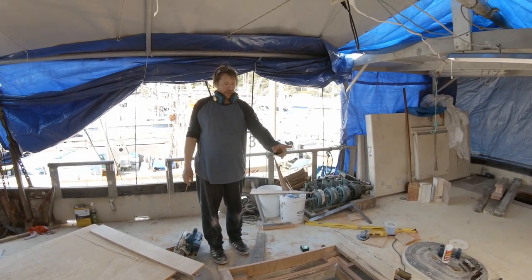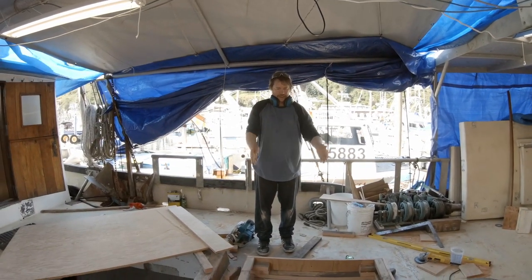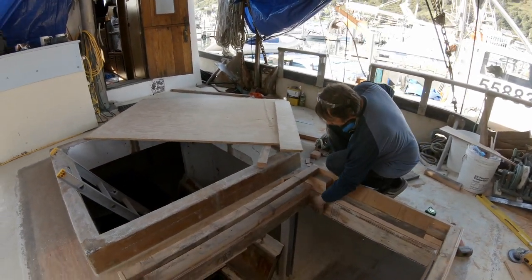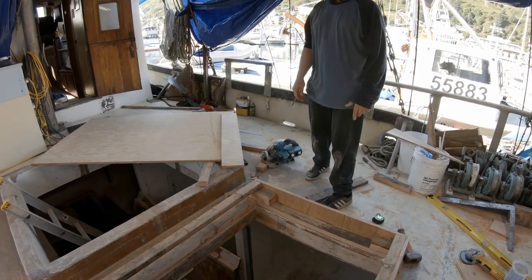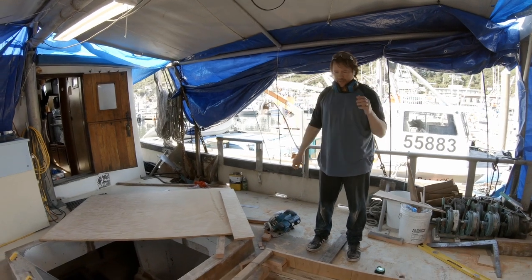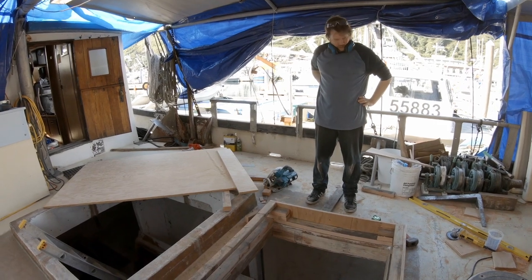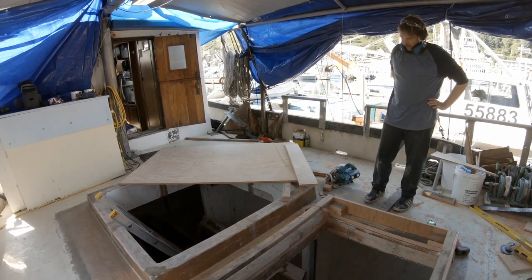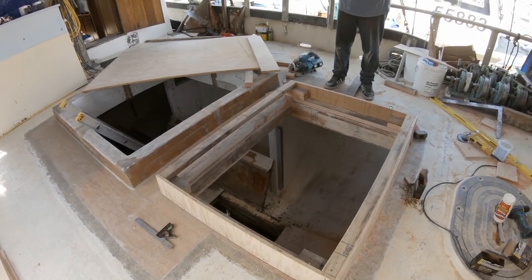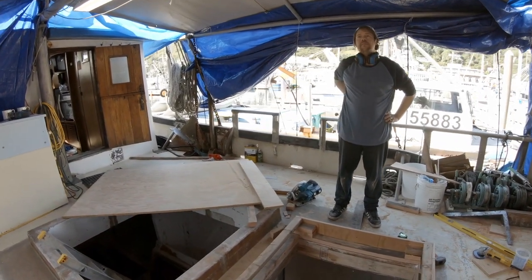Let's throw a couple of little uprights in the middle there, and then we'll put a piece of plywood on the inside skin, and it'll cover all this, come down, cover these beams, and tie all this stuff together. At that time we'll shoot a little foam in any gaps and cracks that we have in here. Looking nice. Looks more or less like this other one when we're done. Get these corners with the grinder to radius them, and the top ones with the router when we get there. Looks pretty good. Feels good to get this one done.